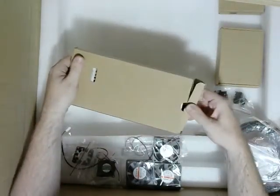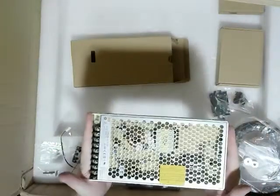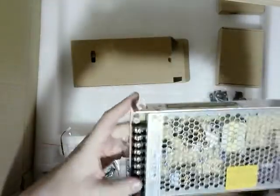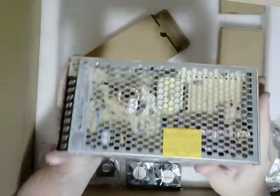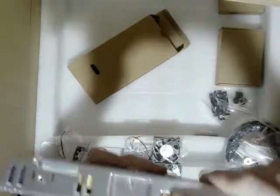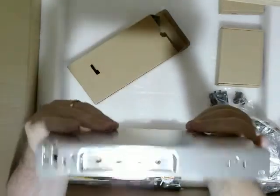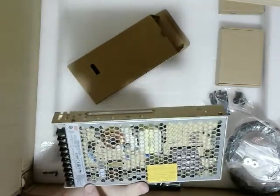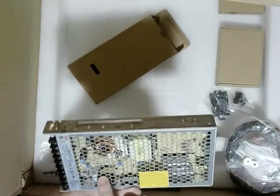Now his big brother, the 200 watt 24 volt power supply. Again, we've got Meanwell. No plastic cap this time. The switch is actually set, on the camera, for 230. So that's nice. I will not pop it immediately. Sorry, my apologies, I'm reading the circuit backwards. Live comes in, filter here, fuse.